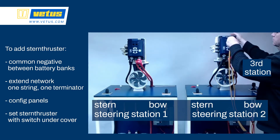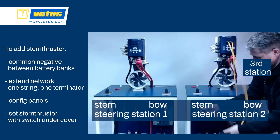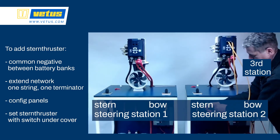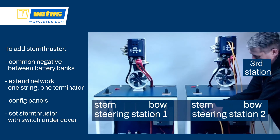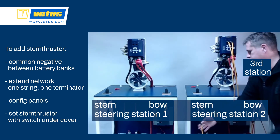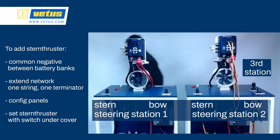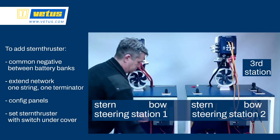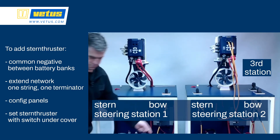Quirin is now hooking up the entire network, making sure that everything is in the system in one continuous string. The order in which you connect items is not important. Make sure that you start at 12V and that you finish with a terminator, so you can run it the way it's most convenient for your boat.